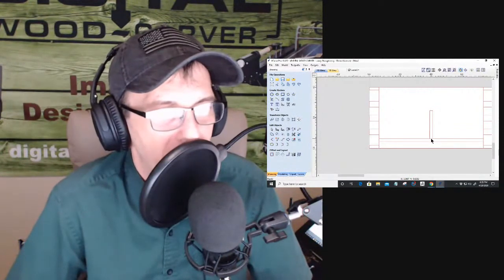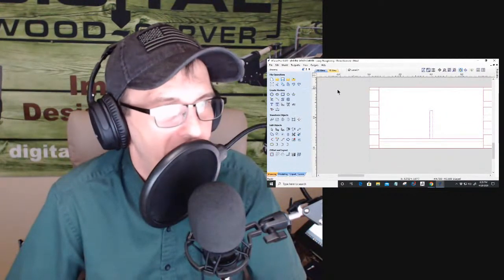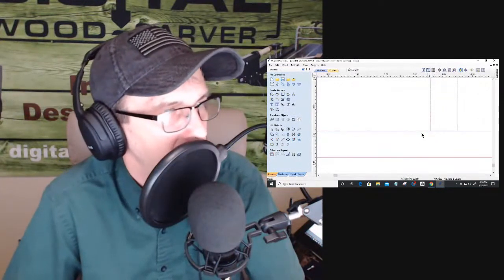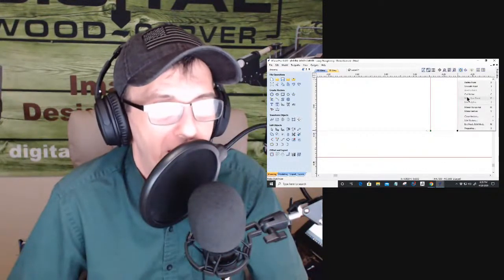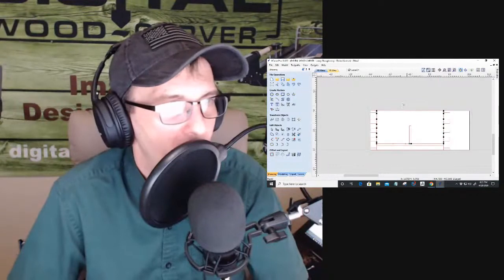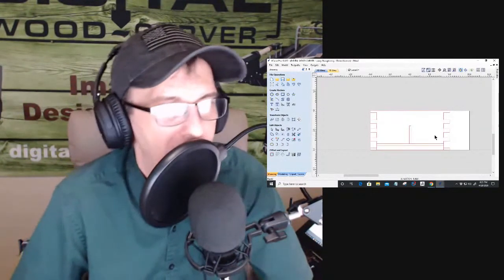Number one is this little rectangle here, delete, gone, don't need it. This rectangle here, don't need all this top stuff, but I do need this pad boy right here. So I'm going to go into node editing mode, and I'm going to cut the vector right there on that corner and cut the vector on that corner to separate this piece from the rest of it. So now I can get out of node editing mode, and the rest of that, I can hit delete on my keyboard, get rid of it.